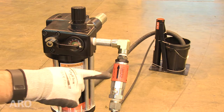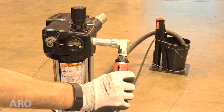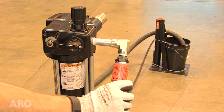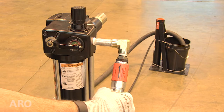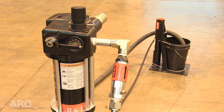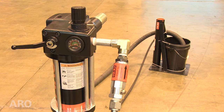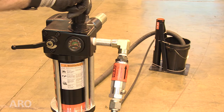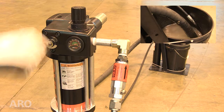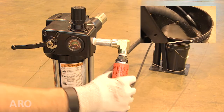Reference the arrow on the sleeve of the Aero Stop valve to confirm the correct direction. To begin adjusting the Aero Stop valve, turn the A sleeve clockwise to the maximum inward position. Next, supply the Aero Stop valve with the desired inlet operating pressure. Then turn the A sleeve counter-clockwise slowly until the pump stops.